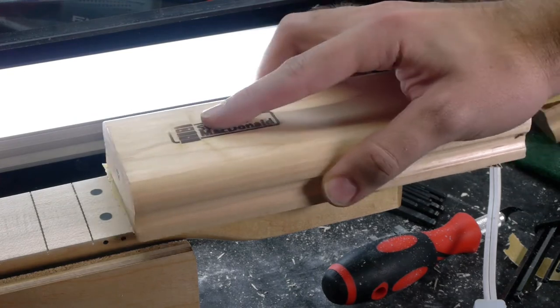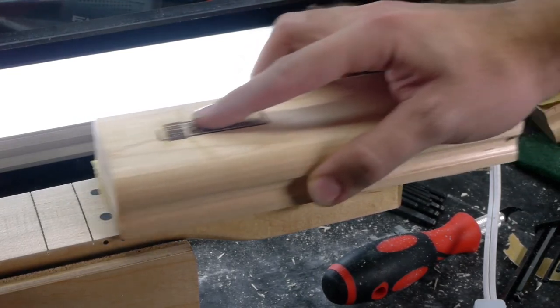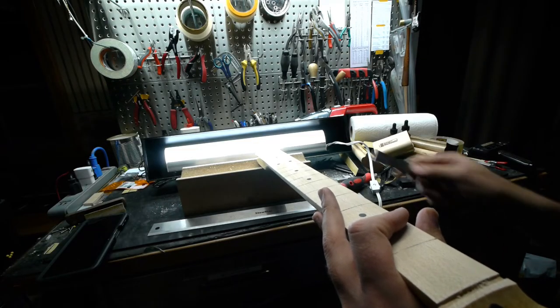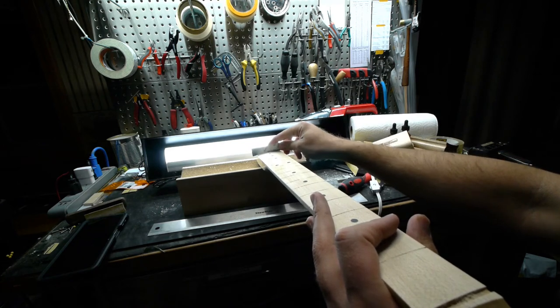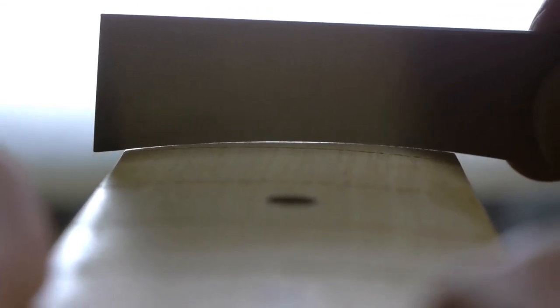It's easy to move the block over to one side or the other if you're not careful. After sanding for a while, I'll check with the radius gauges to make sure everything looks good. Using the same light I used behind the straight edge, I'll hold the neck up and put the radius gauge on. Good light is critical for accuracy. I can see here that the 7.25 radius is not as dead on as I thought it was and needs some more work.